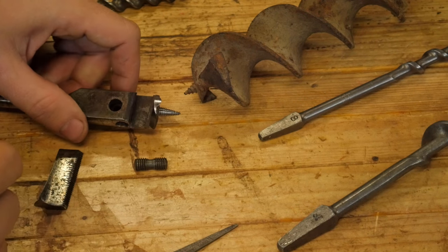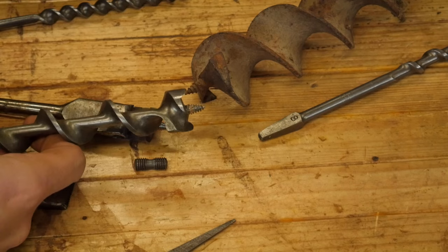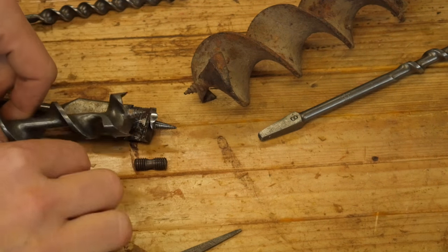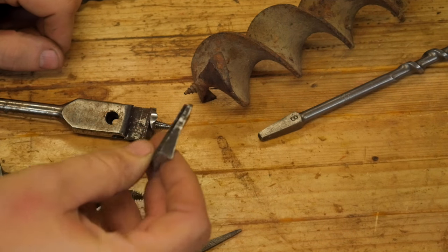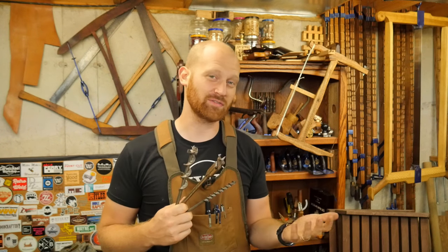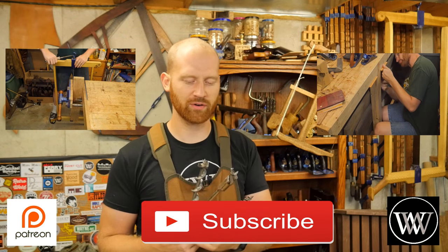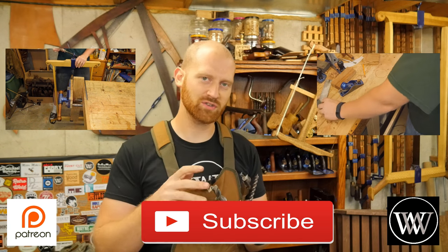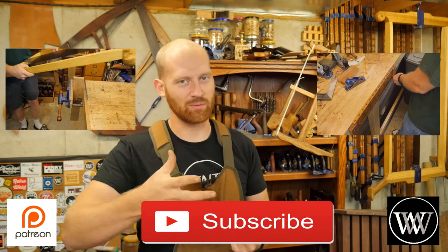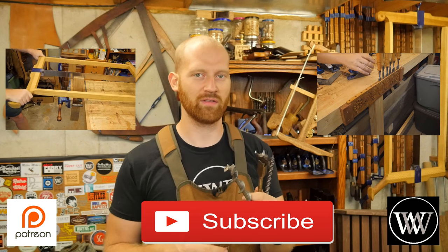Once you understand the basics — sharpen the underside of the blade and the inside of the knicker — you can really go to town on most any auger. There are many other types, but they're all basically the same thing: inside of the knicker and underside of the blade, unless there is no underside, in which case you do the top side. You don't sharpen the outside of an auger because that will change the size of the hole. If you understand the geometry and how they're supposed to cut, you start to see how they should be sharpened. Keep that careful and these will treat you very well and become extremely efficient — they pull through the wood very, very well.